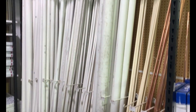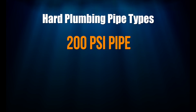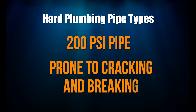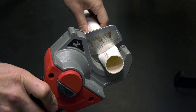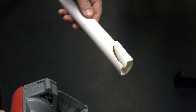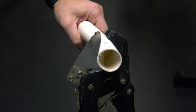The first decision is the type of PVC pipe you're going to use. In a saltwater tank, there are a couple of choices. 200 psi pipe has a thinner wall which makes it lighter and cheaper. It's also prone to cracking, especially when you cut it, and it can also break easier than other types of pipe. Here's how easy it is to crack 200 psi pipe — oops. This pipe is now ruined and you'd have to start over with a fresh cut. Even with mechanical shears, 200 psi pipe is still going to flex and crack.